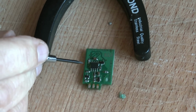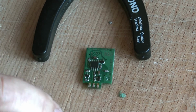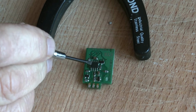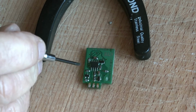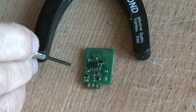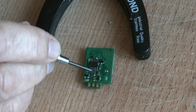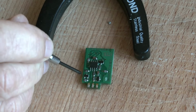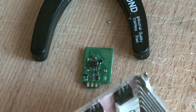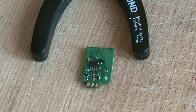This little chip drives the two MOSFETs that we've just replaced, and it switches them both on and off simultaneously. And now I checked the outputs of this chip, and they don't seem damaged. And from the MOSFET drive of this chip, they go through two little networks, this one here, and I think that one over there, that do some sort of voltage protection between the gate of the MOSFET on the board and the MOSFET drivers on this little chip, and all seems well.